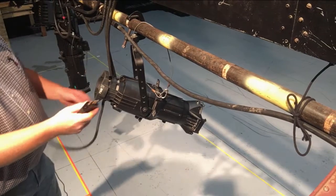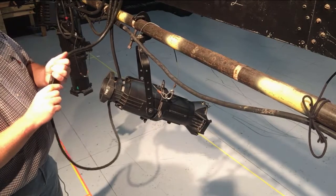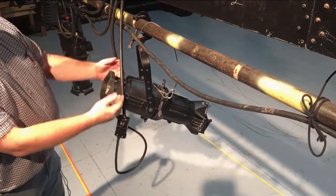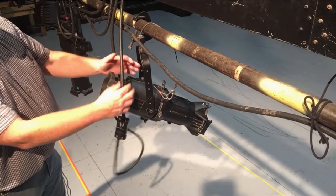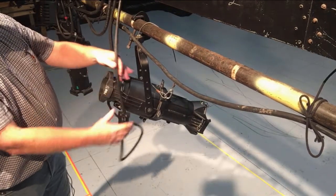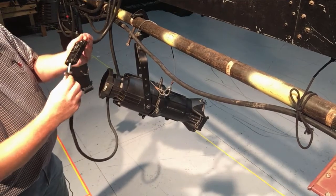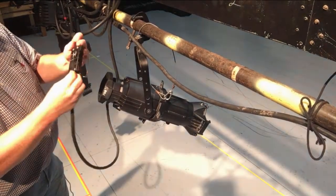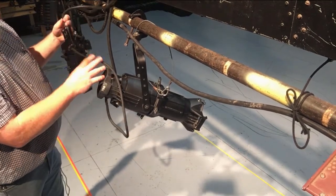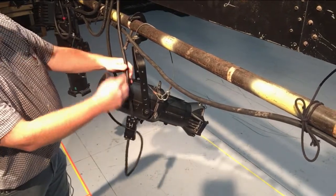Next we circuit it — take our cord and plug it into the circuit nearby. But wait — we're not done, because the rubber part of the cord is touching the hot part of the light. Rubber insulation will burn on the back of the light. The other cable has fiberglass insulation with a Teflon or silicone-type coating — if that part touches the back of the light it's not ideal but not hazardous. But if the rubber-insulated part is touching it, it's going to melt and burn and cause all kinds of problems.